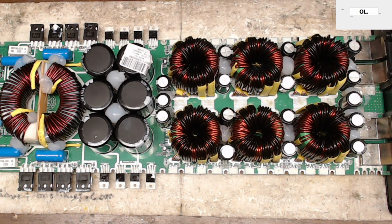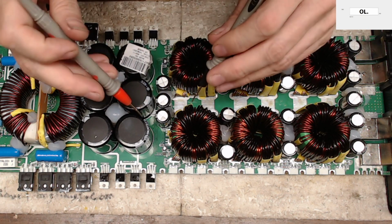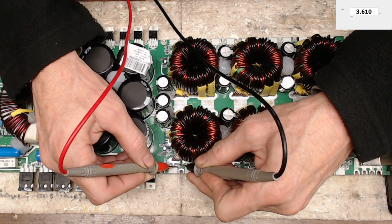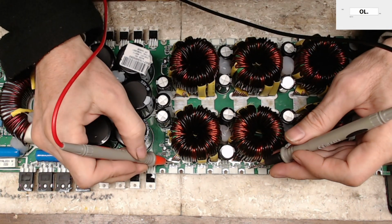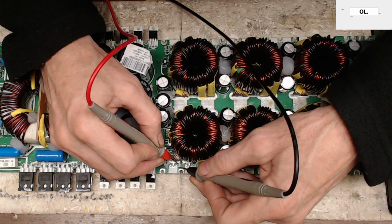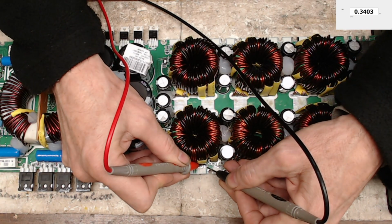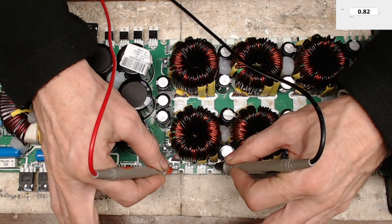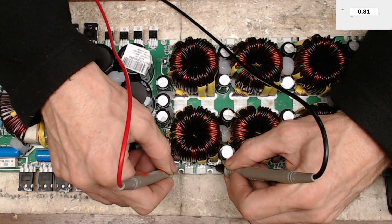Yes, so our gate drive seems to be shorted. That's unfortunate. Let me just do some more double checks here before I pull the drive IC. See, these numbers are all over the place, and 4.7 ohm resistors, usually if they fail, they'll fail open. They burn right open, kind of like a fuse. And none of these physically have burnt open, which is telling me that this gate drive is shorted to ground. So the gate drive itself is 0.8 ohms to ground.